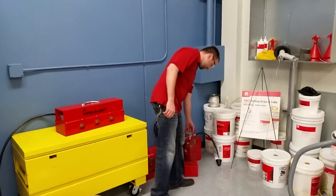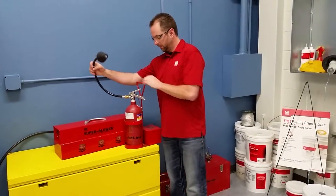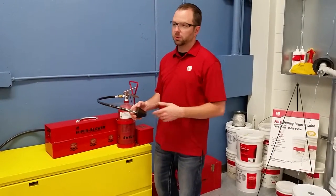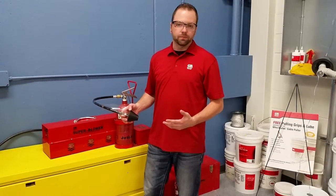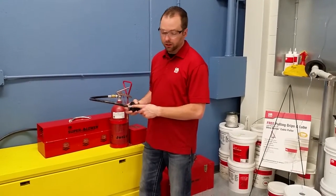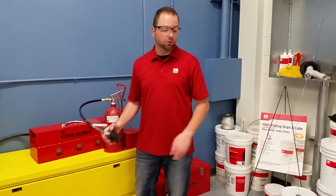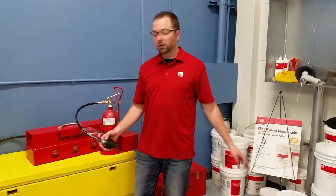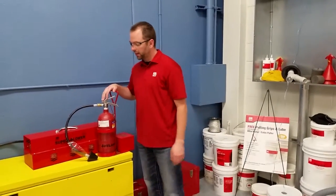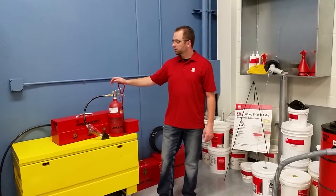The next one is one of our CO2 systems. This one is the most preferred method of getting your line over, just because you don't need any power — CO2 is the fuel. You put your line carrier through here, it comes out this side, and it literally rockets the line carrier through to the other side. It works much faster than any one of the blower units that we have. These come in 20 and 50 pound tanks with a jack to wheel them around with, except for the smaller one.